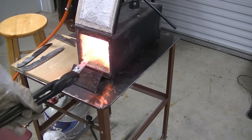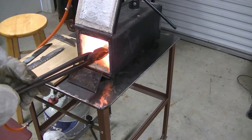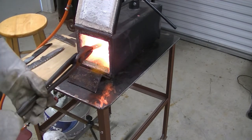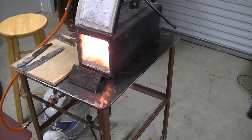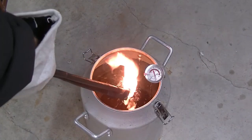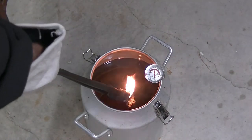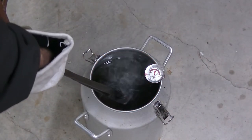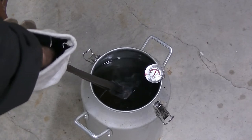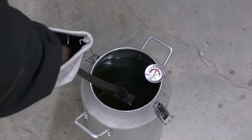Let's keep it moving. It's ready to go straight into the oil. We've got the knife up to temperature now — we're just going to place it in the oil. Straight in, straight out. In and out, in and out — just straight up and down. You'll have less chance of getting warpage if you'll just take your time and quench it, moving it slowly in and out.